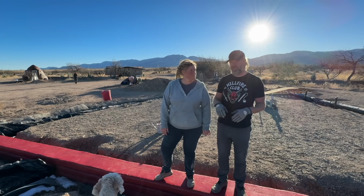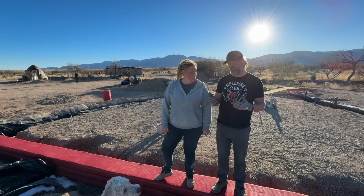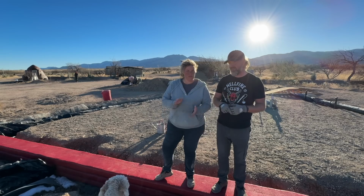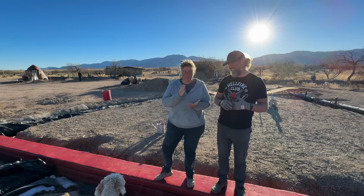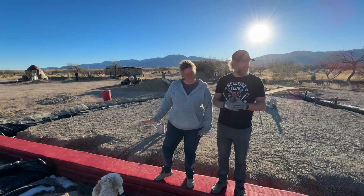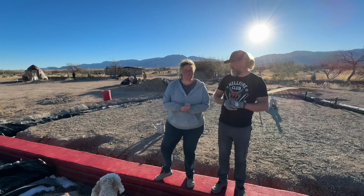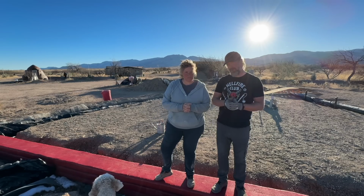There's a few other things. We just need to get into the 3D model and try a few things and see what's actually gonna make the most sense. So we're big advocates on buttressing. We tell everybody you should buttress every 10 to 12 feet, no more. And somehow we ended up with a 16-foot wall without a buttress. So we should follow our own advice. Maybe while we have a rainy day tomorrow, maybe that's what we'll be working on.